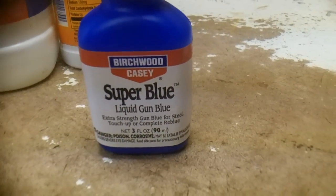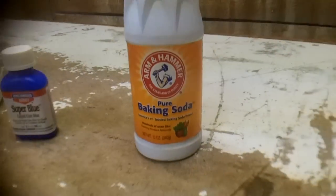To recap: get yourself some muriatic acid to clean off the zinc, get some Super Blue available at your local big box store — rhymes with 'small mart' — get some baking soda to neutralize the acid, and of course safety first: wear your mask, gloves, and all that stuff that I wasn't doing because I'm an idiot. If you're looking to black your steel and you don't want to paint it because you're not a beginner, do this — this is awesome. I've never done this before and I'm really glad it worked out this well. Thanks for watching — hit subscribe for more quick tips and experiments like this.